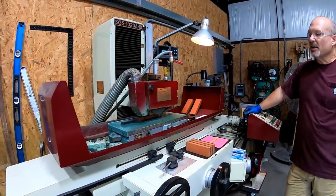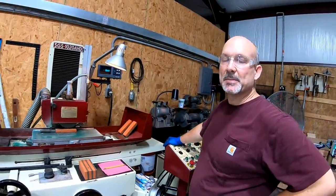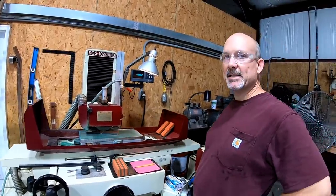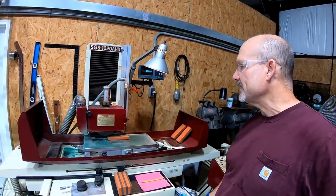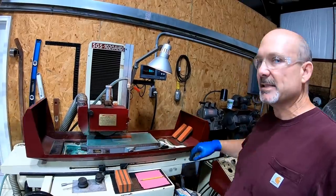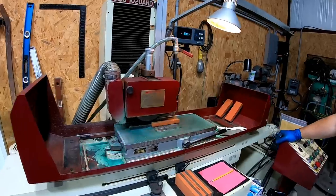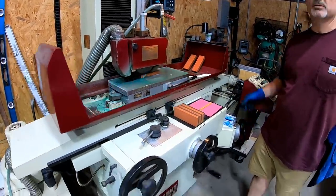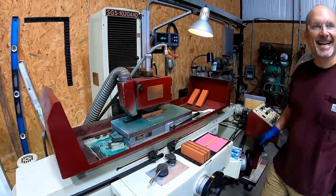It's kind of interesting because when I mention how much I cut a pass on some of these stones, people are really shocked. But when we're grinding with diamond, you can take a pretty heavy cut. If people go up to Robin Renzetti's video explanation of how to cut these, they'll see he takes some pretty assertive cuts. This isn't steel. Yeah, she can be a lot more aggressive. It really goes a lot faster than what I originally thought. I mean, you get across there really quick. You can see the traverse here. Yeah, don't tell anybody. We won't show anybody.